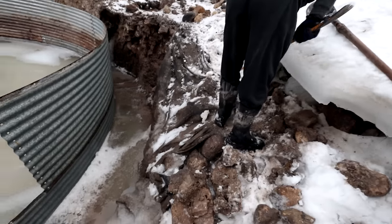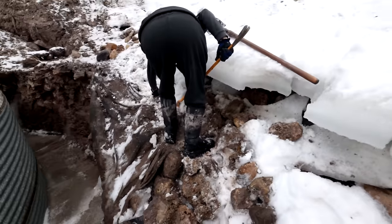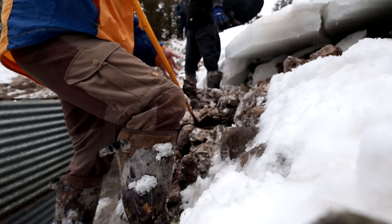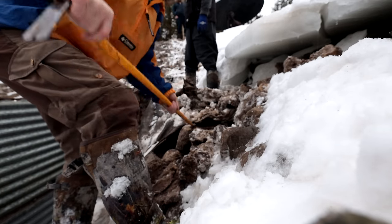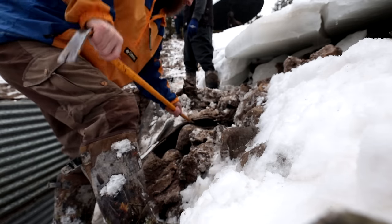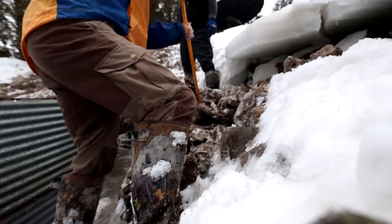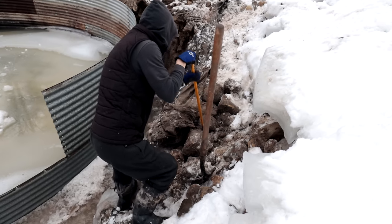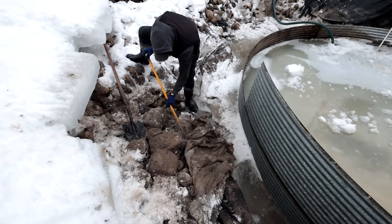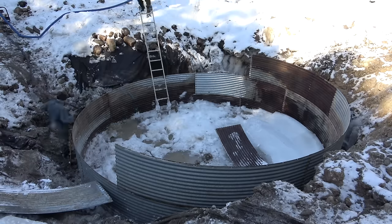So there are obviously some pros and cons of working on this pond in the winter. The obvious pro is that we're not destroying prime habitat for the summer season, so we can actually enjoy it. That's the main driver. The drawback, of course, is that everything freezes, and I mean everything. The geotextile, having been wet the day before, is now dried solid, as in frozen. We had flipped it back in milder weather, and now we have to find the edge and tie it back. The idea is to make the entire basin of the pond completely covered in geotextile and rock. If we just ignore a section because we can't see it, doesn't mean it's not there. Once we got that tied back in, then we can start doing the work we actually intended to do. But this was something that was keeping us busy while we were pumping down the pond.